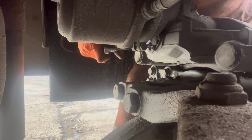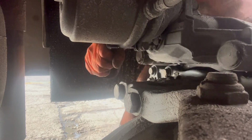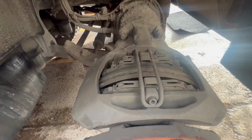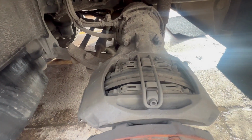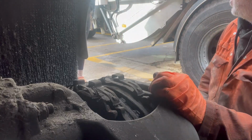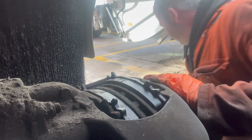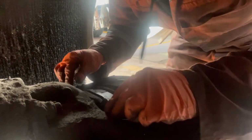You can see then a slip caliper, it's not tight on its slides around. So once that's backed off, undo that, pull the bar out, and your pads come out then. Dead simple. So we'll crack on and get that done. Need to back it off a bit more. That's it. Backed off the rest of it. Pads just set in nicely there.